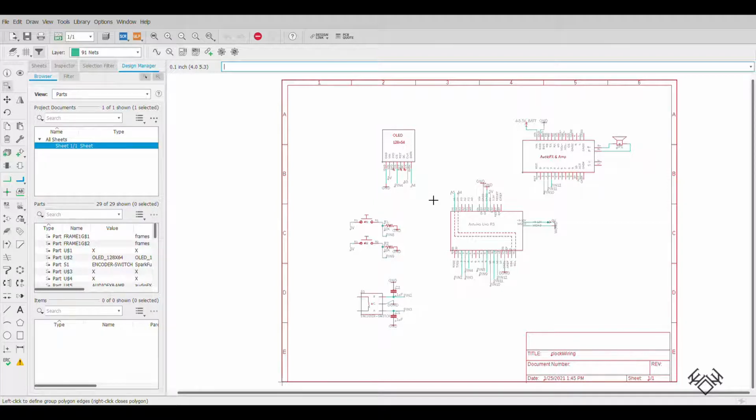I chose the audio FX board I did mainly because it does all of its processing on board, meaning that the Arduino only had to send short signals in order to play all of the sounds I wanted. This meant that more of the bandwidth of the Arduino Uno could be used for clock-related things other than sound.